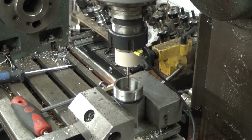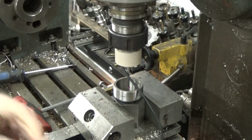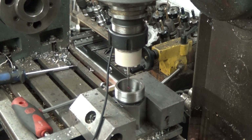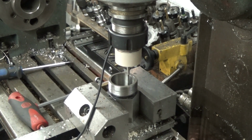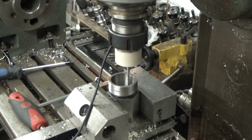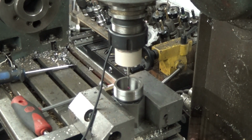So repeatability is good, but the elephant in the room is the actual centering. So if I rotate this through 180 degrees, we should then know how well it is centered. This doesn't cover the lobing or lobularity error which you get with these 3-point things. Okay, that's 0.3mm in X and -0.6mm in Y, which kind of figures because we saw the ball wobbling. Of course, every machine probe I've seen has adjustment for centering the ball.